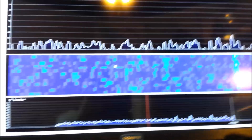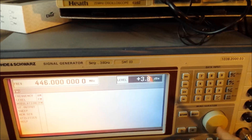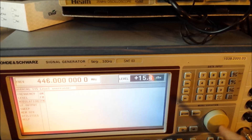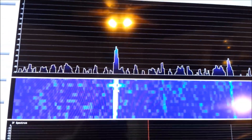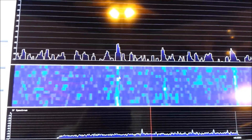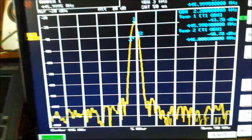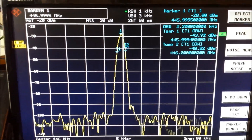Let's jack up the gain and see how much we can push it. I think this thing goes to positive — right around 16. Let's go down to 14. Now we got something — the tuner still works. But it took that much more — about 15 dB more signal at least. We're up to negative 28 now on the spectrum analyzer. Before we were at negative 43 or so, and that just gives us a hint of a signal there.